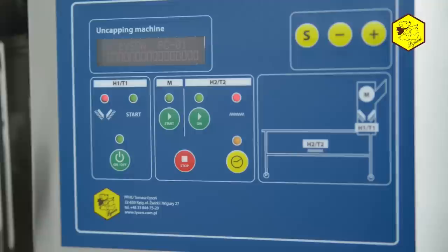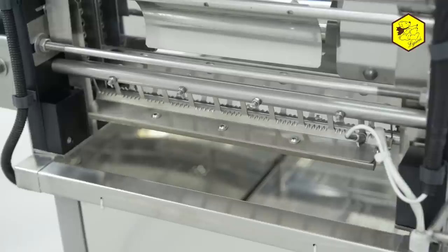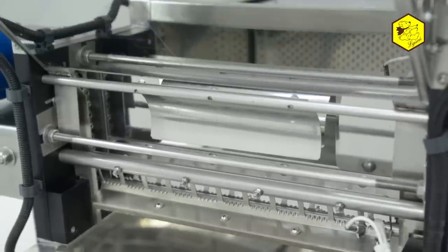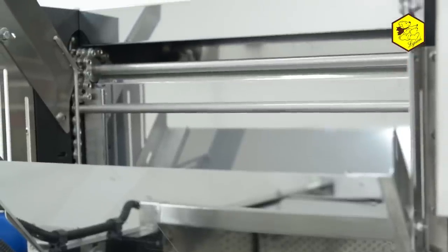The automatic one has a control for use with or without heating the base. The control with the heating facility is equipped with a memory setting, self-diagnostic procedures, and digital temperature measurement inputs. The temperature sensors used do not require calibration and they guarantee accuracy of measurement to 0.5 degrees Celsius.